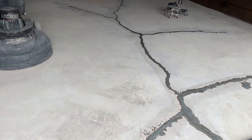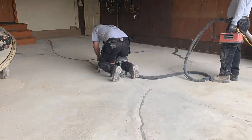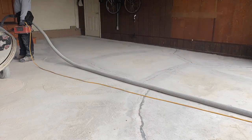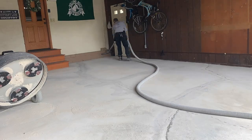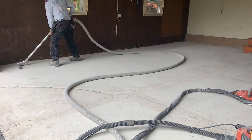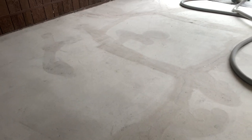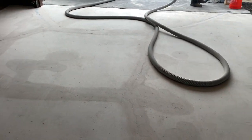I'll set this up so you can watch me grind. When I grind, I always grind in a circular motion — that's just what I like to do. I grind over all the cracks to get a good rough surface and grind off all the excess epoxy on the surface. Jeff's going to do the final vacuuming and we are going to get ready for our prime coat. I know this is a little noisy — that's the scratch you want in the floor. We're all prepped and vacuuming; we're going to get this prime coat down in a couple minutes.